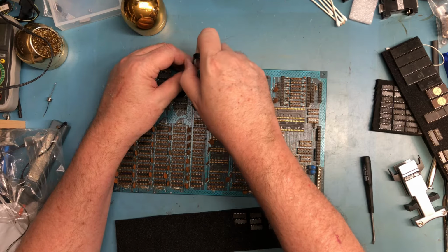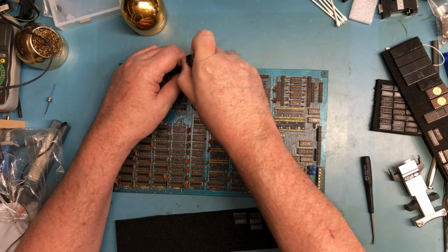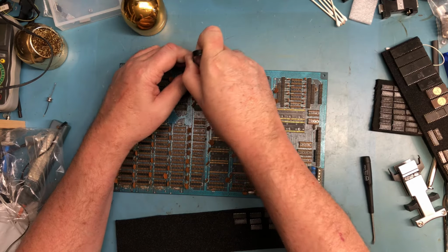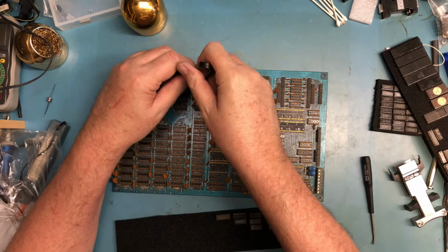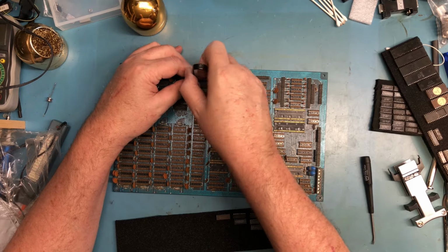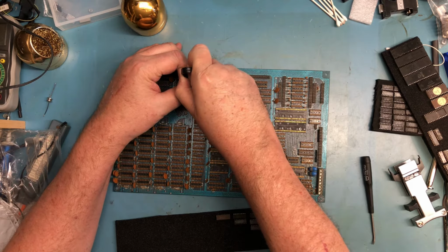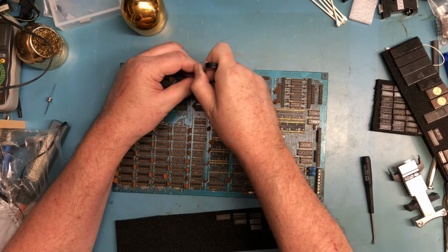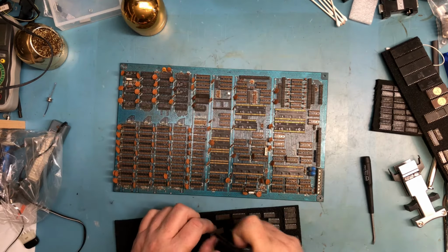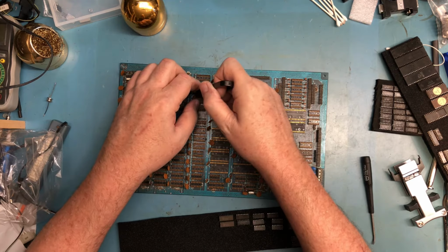I keep starting to talk about that Apple II board where we had huge amounts of lead rot, lots and lots of oxidized pins on ICs. I believe there were actually single wipe sockets on that board. I could be wrong, but we had sockets, as I recall, that required replacing. They couldn't be cleaned up, were too dirty inside. I'm not seeing anything that looks that bad here.